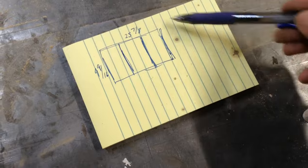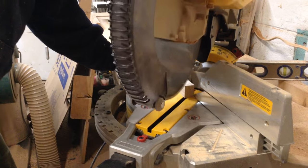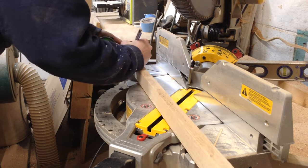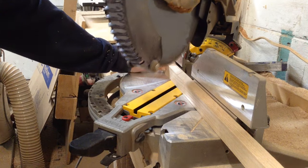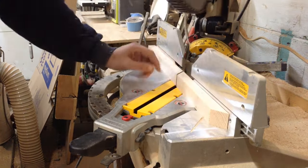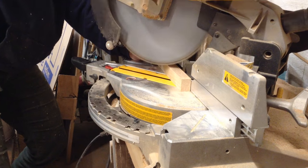This Christmas, as a present, he asked me to create a similar frame with the exact same outer dimensions, but we designed it more like a shadow box because he's putting plaster cast paw prints inside, so it will have more depth. Very simple project for anyone looking to make a shadow box style frame. You can amend all of these dimensions if you want your shadow box to be thicker, but I was making mine out of some oak I had laying around, making it an inch and a half thick. It will also have an attached frame on top, and that will make more sense when you see how I've designed this.